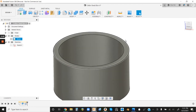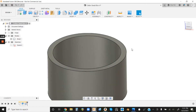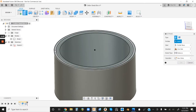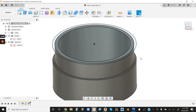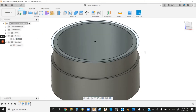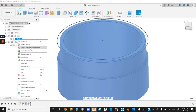We'll make some adjustments later to optimize it, but for now let's keep going. You'll notice our original sketch disappeared — we still want to use it, so make it visible again. Go to your Sketches dropdown, find Sketch 1, and click the eyeball to make it visible. Now we're gonna use Extrude again to cut our outer lip down where the threads are gonna go. Left-click Extrude, select the outermost profile, type in minus 15, and hit Enter — you should see it cut that away and the box is mostly done.